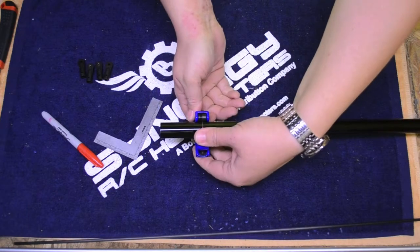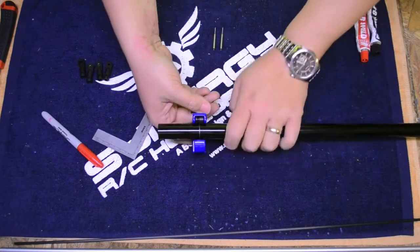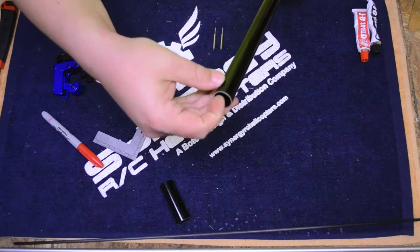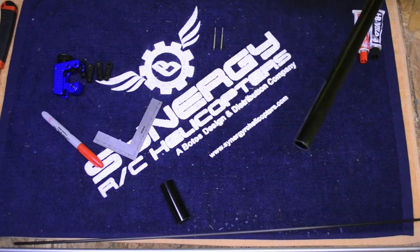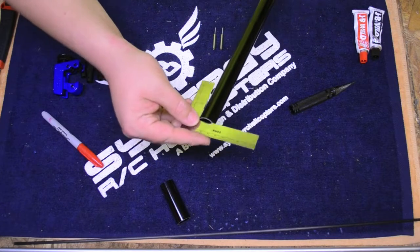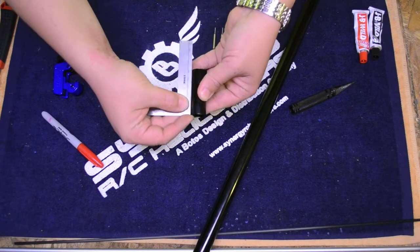You can see it's really marking that boom now. Little cuts, little tightens — I'm not going real fast at all. I do not want to compress the boom, I want to cut it. And I'm done — cuts clean. Might be a little bit of a burr there. I like to take my reamer and just check it out to make sure the edge is good. That cut is square, straight, and not jagged. I cut it nice and slow and the cut is fine. Just to be safe, I take the piece I've already cut and measure it — right at 60 millimeters. That is perfect.